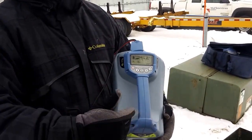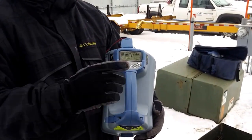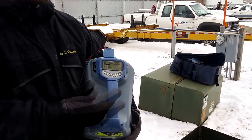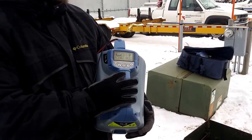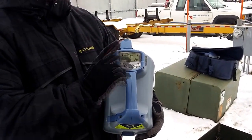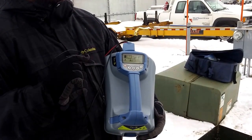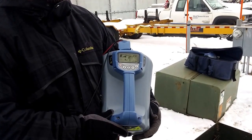You're just going to wear your batteries down faster. If the fault is really close to the transformer, you may want to turn it down a little bit, but for the most part we'll go ahead and go to 100%. This unit runs a lithium-ion battery so it's going to last a long time versus alkalines, which won't last long at all in fault find mode since you're using quite a bit more power than in regular locate mode at 30 volts. You can locate the line first using one of the locate frequencies — 512, 8, or 33. But if it's already located, go to fault find mode, which is 8 kilohertz. In fault find mode you'll see a little A-frame icon. Select the A-frame icon at 8 kilohertz, turn it up to 100%, and you're set to go.